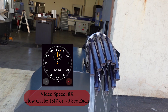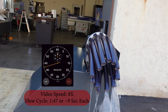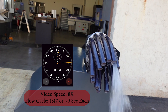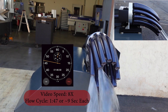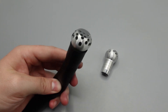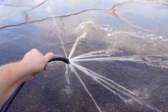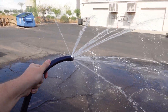Here you can see me turning on a garden hose headed towards our assembly. About 99% of the flow comes out of one outlet at a time, and each one is only on for nine seconds. What we do with the outlet of each of those is route them towards these nozzles. We make these in-house — they have 19 angled holes drilled in them — and the purpose of that is to push as much debris as possible directly underneath the nozzle.